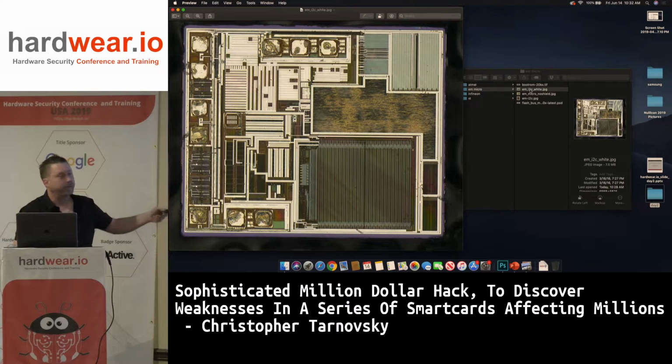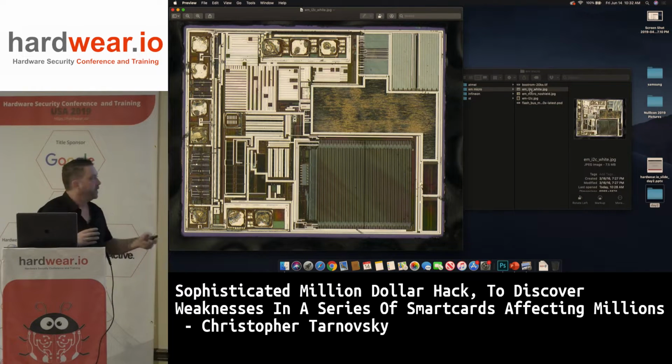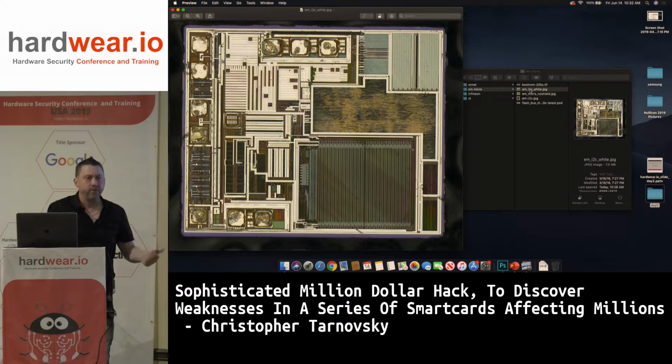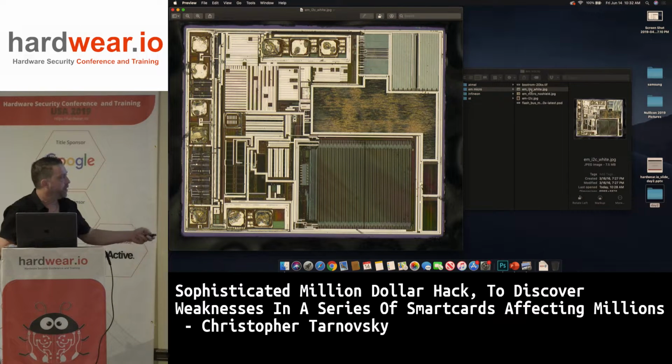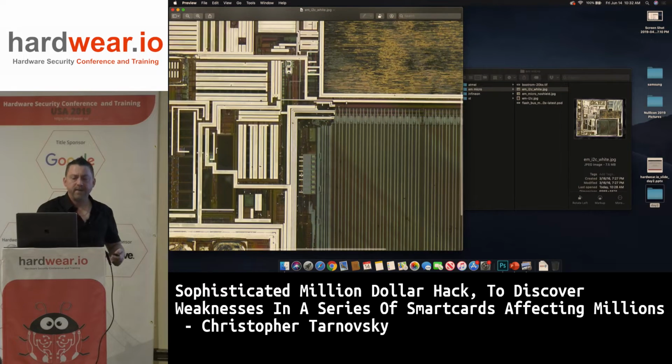So basically I made the ROM skip all of its self checks. If the ROM knew what I was going to do to this flash, it would erase it and put me back into bootloader mode, because these chips have a bootloader where you can download into this flash. So the flash drivers were here. And the game's not even over.